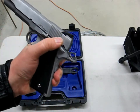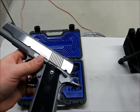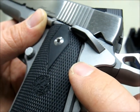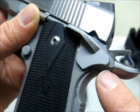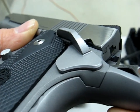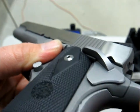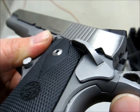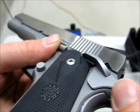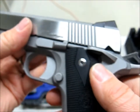The only thing I would change — that I will change — is this edge right here is a little sharp on my thumb. I use a high grip, so I come up through here. And also this little lip is a little bit proud of the radius of the rear of the frame. I'm going to take that down a little bit with maybe an India stone or a file, and then polish it down. I could have it bead blasted again to match, or I could just not worry about it, which is what I usually do. But that rubs on me a little bit with my thumb over the safety grip. That's the only issue I have.